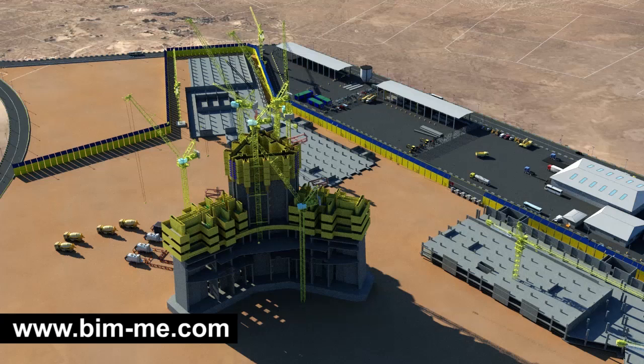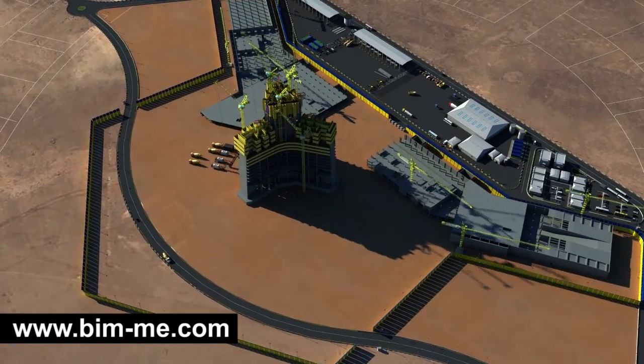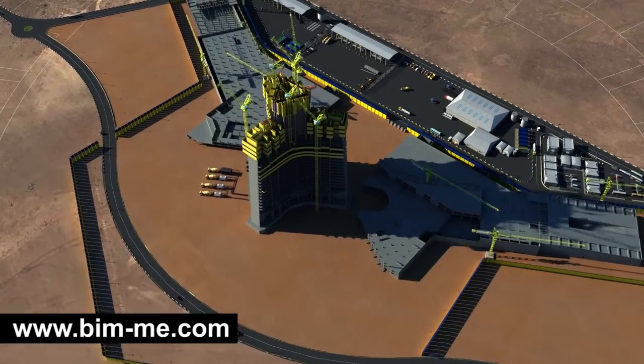While installation of concrete foundations for external cranes TC 4, TC 5, and TC 6 will take place, installation of TC 3 on the tower raft will occur when the core reaches level 10. TC 1, 2, and 3 will be climbing in the center core following the formwork sequence.